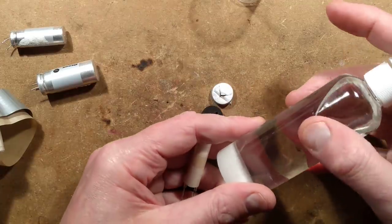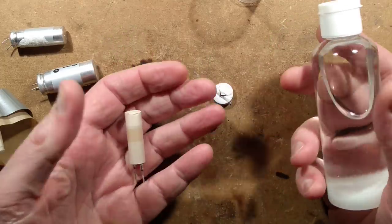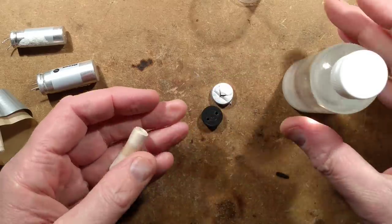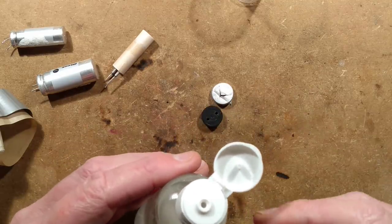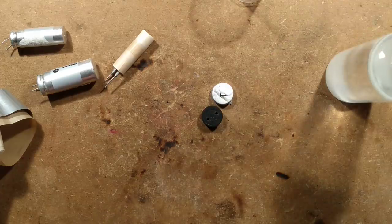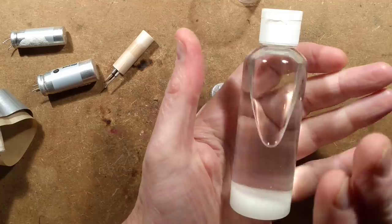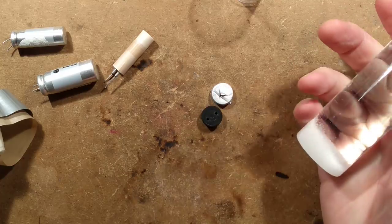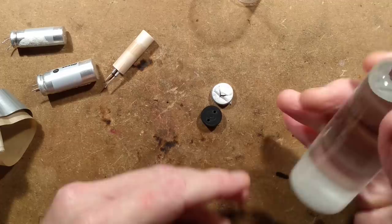The science of this stuff: this is a traditional ethylene glycol and boric acid electrolyte, also used as wood treatment. It's fairly safe — I mean, you wouldn't want to drink ethylene glycol or inhale the vapour because it's considered toxic. Let's taste it — sweet, like you'd normally expect of glycol. I didn't want to leave that in my mouth too long. There was also a slight saltiness imparted by the boric acid. I know it tastes salty — I've tasted boric acid in the past. It's less toxic theoretically than table salt, and although they call it an acid, it's not really terribly acidic.